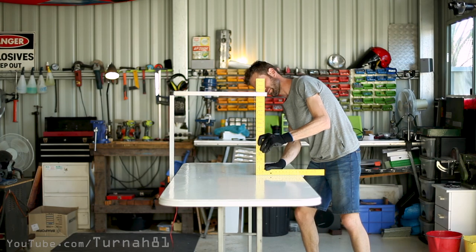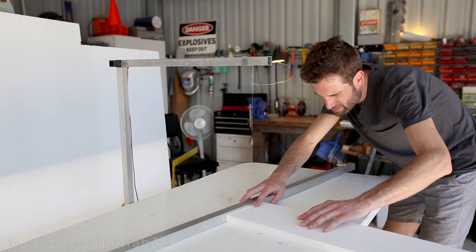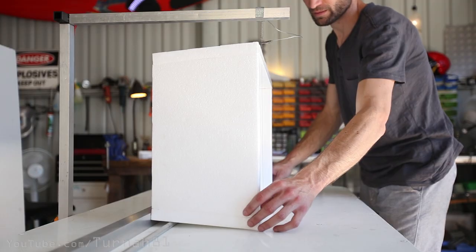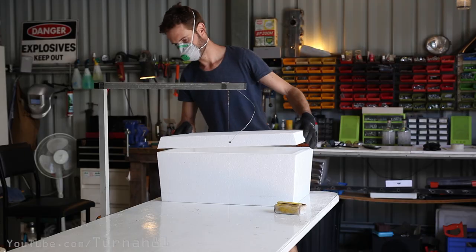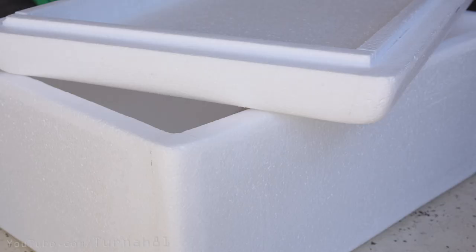With the design worked out on paper, I had to cut some polystyrene quite accurately. The best way to do that is with a foam cutting table — looking them up they're about $700, so I improvised one in about 30 minutes and it turned out way better than I thought. The foam part was pretty hard — you have to have all edges and lines perfectly straight, because if you get something wrong you can't sand large sections of foam as it plucks and pulls. You want to get the cuts right the first time. And you can't bog mistakes either because that would weigh the cooler drone down. The only sanding I wanted done was just rounding the corners. Then with the right glue I went about gluing all the panels together, holding them in place overnight to dry. After a while the cooler had become a nice cooler shape.